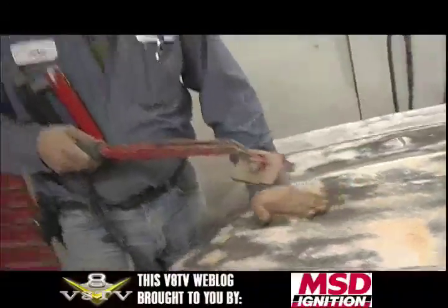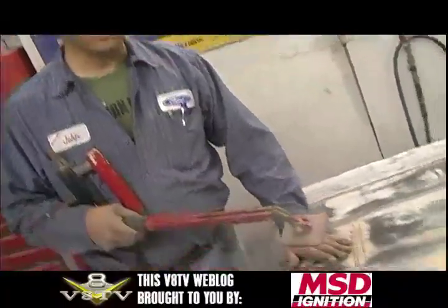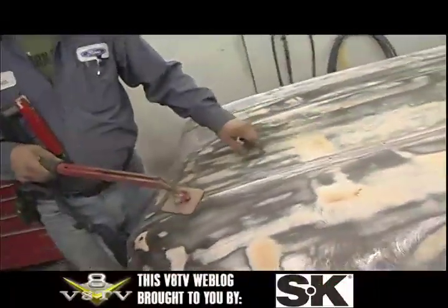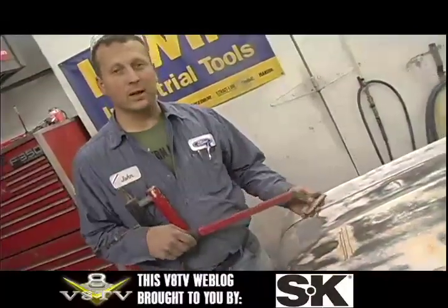And then just a little amount of mud now. Instead of having a thick spot — a quarter inch or better — now I'll have something back to an eighth inch or less. You can work out big dents. You can start outside and just work them in like a bullseye, slow. I like this a lot better.